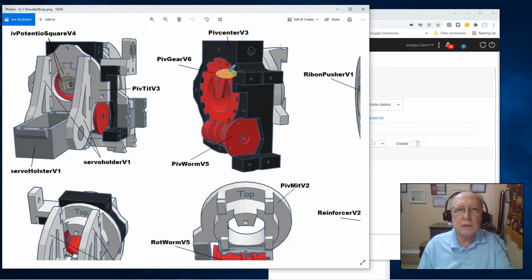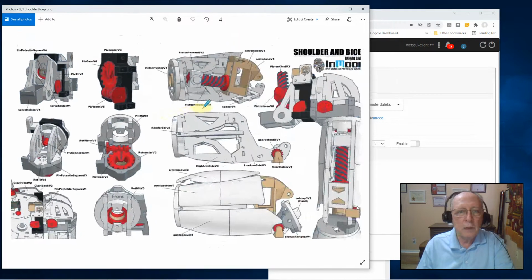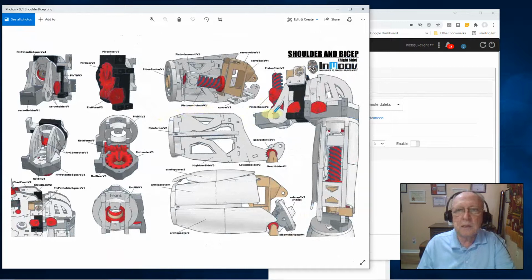So when you put this together, you can rotate your worm gear and get that alignment close. That's what I would do and did, and just leave it aligned at least close to that zero reference to make your final adjustments much easier. We may come back to this to discuss other areas, in this area in particular over here.